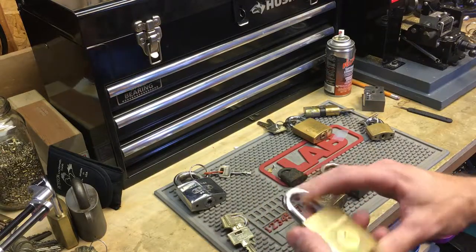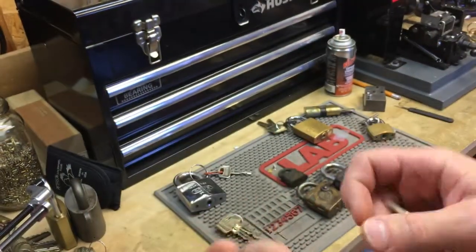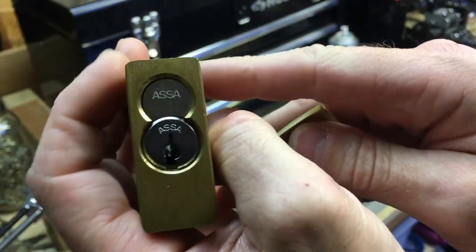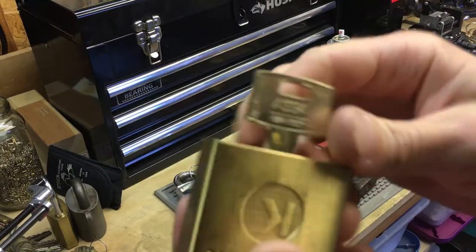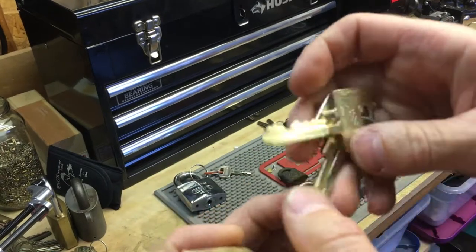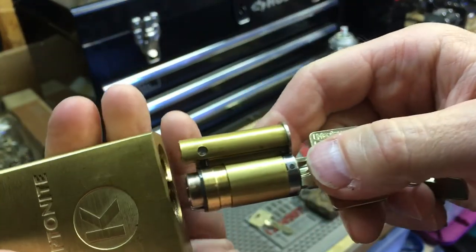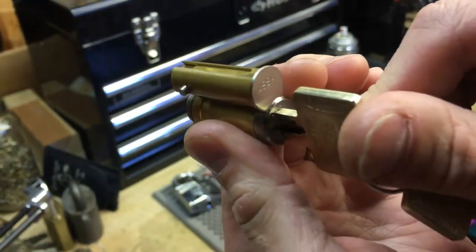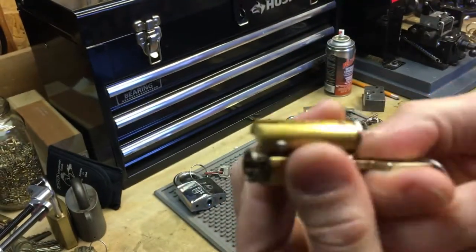The first thing I think is cool — I found this old Kryptonite padlock at our shop. It has a large format Schlage core, but I put an Assa Max Plus in there, and I thought that was cool. I really like the Assa stuff and the Assa sidebars. You just have to pin it differently to be able to get the core out. Here you can see the little plunger goes in and out with this key, and then this one turns it like you'd expect — that's kind of cool.